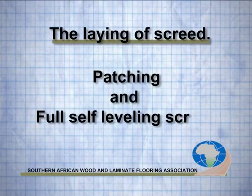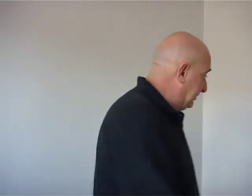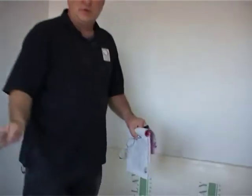Now we're going to show you the two situations, a patching of a screed and a full screed. So that's self-leveler, let's do that. This room, we're going to do a full screed here. It's a self-leveler. It's only 5 millimeter thick when it dries, but it'll give you a level floor. So we're just going to tape the walls up so we don't get any of the slurry onto the walls themselves. We're also going to first prime the floor, because the primer is like a bonding liquid. It actually bonds the leveling screed to